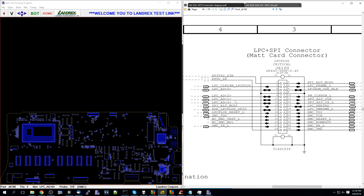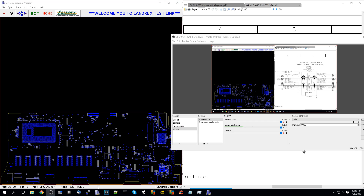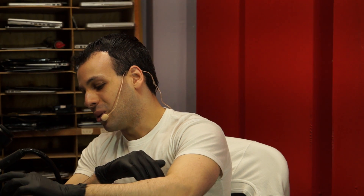So if you have corrosion on this, it's not like you can just say that corrosion is not localized to something that components plug into, therefore I can ignore it. This is actually one of the most important places on the board to avoid corrosion. You can actually fix a board by literally removing the connector. This was a perfectly clean board besides one tiny little bit of corrosion on the connector. I put flux on it, I put some hot air on it, I removed it, and then I tinned the pads with solder just to make sure there was no issue.